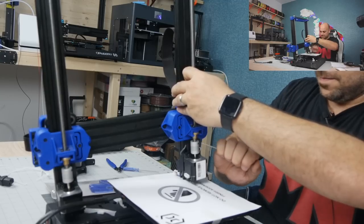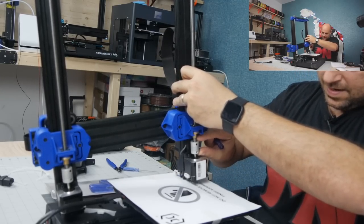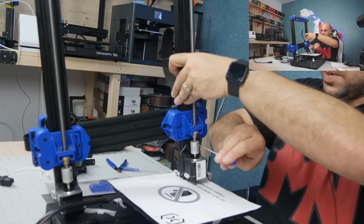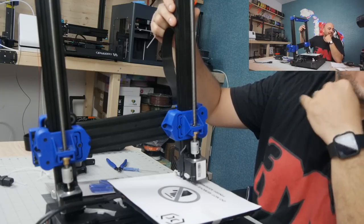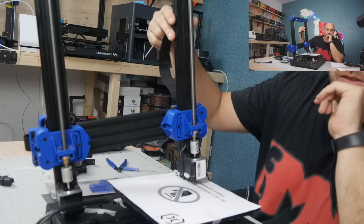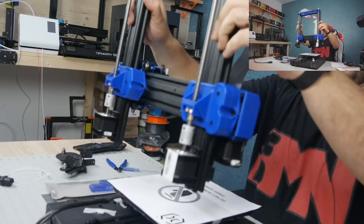Okay. There you go. That's all it needed. Just a bit of slack there. I'll probably check that again once I assemble it, just to make sure that the gantry is aligned. Does this have thermal runaway protection? Yes, at least the Artillery Sidewinder X1 did. I'm guessing this one has as well. The one you're working on looks stretched out. The other looks compressed. Yep, they both need a bit of playing around. So I'll assemble it so then I can play around with it.